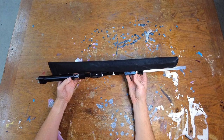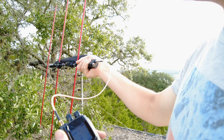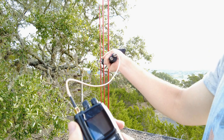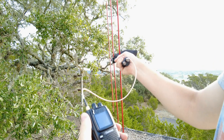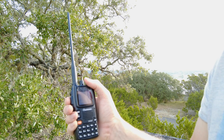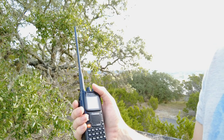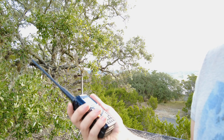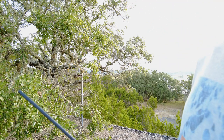The STLs will be linked below in case you want to print all these parts yourself. We've worked our way out to a repeater — this is the furthest one I'll be able to hit with this antenna, just a little over 50 miles away, and it seems we can hit it pretty reliably with a good signal coming back. With the stock antenna we can still receive, but we can't open the repeater — so transmitting that far is definitely outside the range of rubber duck antennas. That's the nice thing about the Yagi: you can really push that signal out there further.